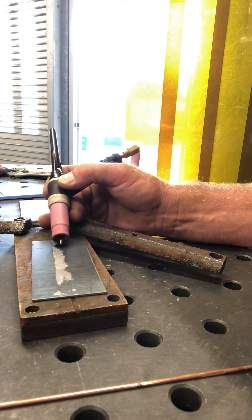Aluminum can be a little bit difficult, but for us it'll be pretty simple. You're just going to start the torch — again, lay it on its side, start the torch, and away you go. You'll just melt this flange down with nice, soft little circles. Get that flange, go over the top, soft circles. Get the flange over the top. Start the arc, reach up, get it nice and hot, and just nice and smooth. Slow hand movement both forward and in your circles — very nice, smooth motion. I'm dragging my pinky on the fixture, finding somewhere I can brace myself against the table so I don't bobble around. If you don't have something on the table you're going to be up in the air and something's going to be goofy.